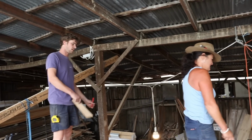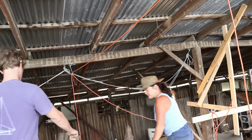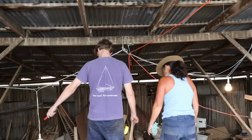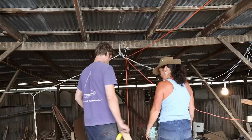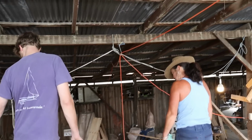So where's our chain plates? Well, we don't want to go too far back. The mast is here, the chain plate's sort of here. So it'll be close, but you don't want to go further aft because then you're losing your angle on the chain plates. So that's probably the spot.